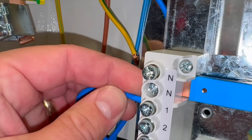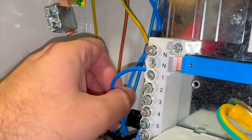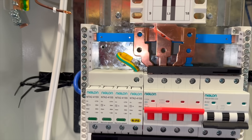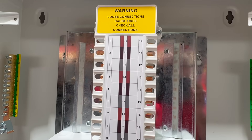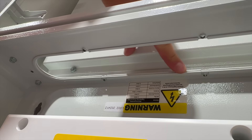The fully shrouded terminals give extra protection when tightening conductors — vital when we are talking about torque accuracy. And the chassis can be removed, which will let you dress the cables properly before refitting. The Protego 125 runs from four-way up to 24, and it can be extended later if the installation grows. And you can fit extension boxes if you're adding timers or contactors.